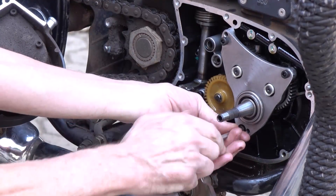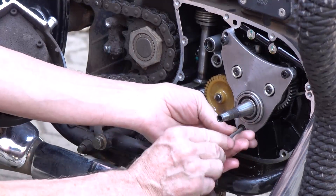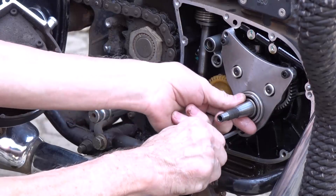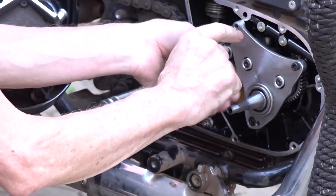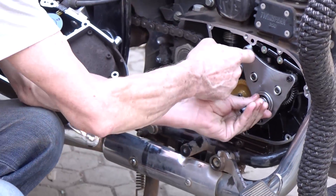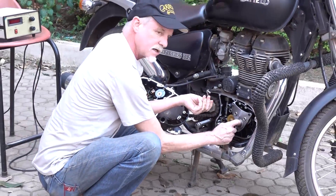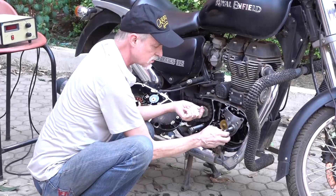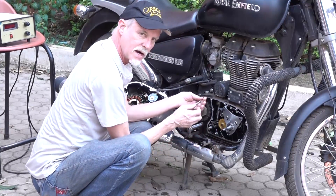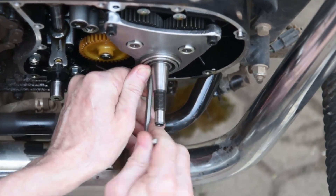The main thing is, when you're doing the final bite, make sure that's just seated in there. So that's located — that's the new locator. You want the bearings to locate the bolts, not the bolts to locate the bearings. Otherwise you're going to preload on the bearing. When you're doing the final bite, make sure that's just in there.